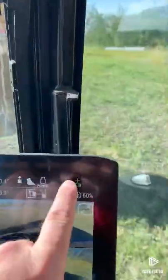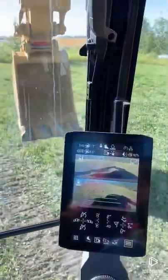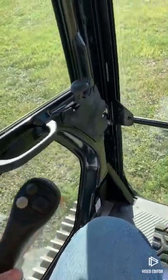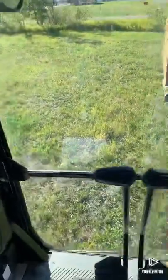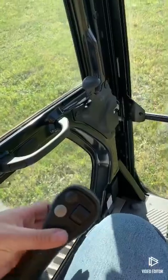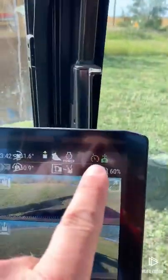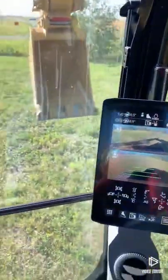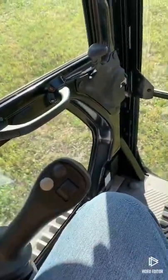We can let go of the joystick and we're tracking ahead — see that speedometer indicator went from orange to green, showing we're in cruise control mode. If you need to steer while in cruise control, no problem, just steer left and right just like you would in manual stick steering. To shut it off, give that bottom button on the back of the left-hand joystick a click, and we come to a stop. The speedometer indicator goes back to orange, identifying that we're in standby mode.